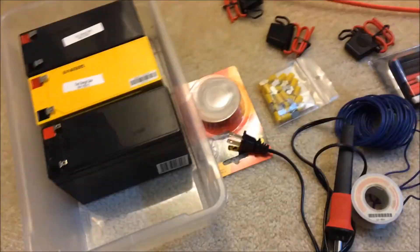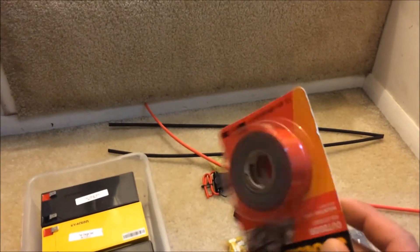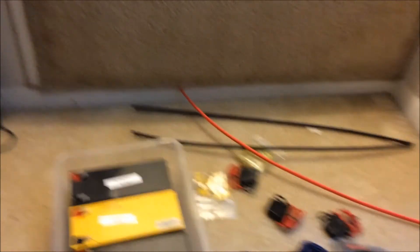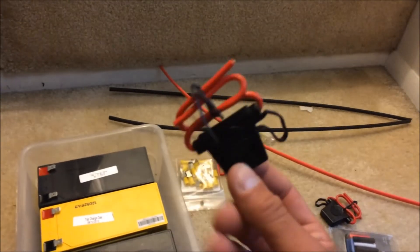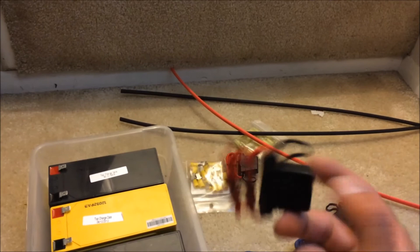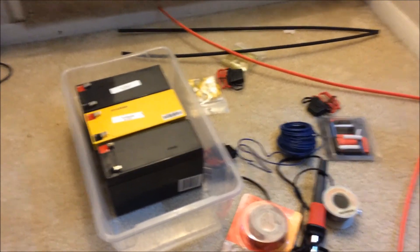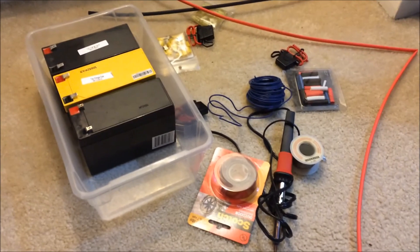I have all the stuff together but I'm not going to get to build this today — sorry, you're going to have to wait until tomorrow. I have double-sided outdoor mounting tape to stick the batteries together, I'm going to wrap them in tape and put a strap around them. I'm going to wire them together using these connectors and this wire, color code the wire with the heat shrink, and wire in the inline fuse on the positive lead. All kinds of fun stuff tomorrow. For now, I'm going to clean the bedding in my hamster enclosure and then go to my fiancée's house because I promised her waffles.